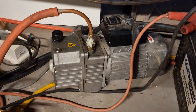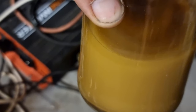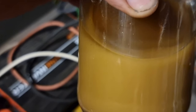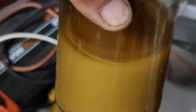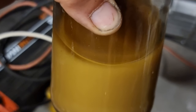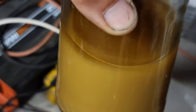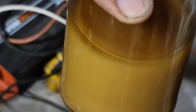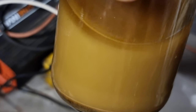This oil came out of the pump — nasty. And it was like water, no yellow oil colour. Oil has a yellow colour very often, but this is just nasty. Maybe it's like hydrogenated vegetable oil, but this is mineral oil, isn't it? I have the bottle somewhere for the oil. And this is just like water — very thin, transparent oil. But now it's kind of yellow and cloudy and it almost looks particulate in there. And that comes out of the pump after a while, and that's maybe chemically changed.